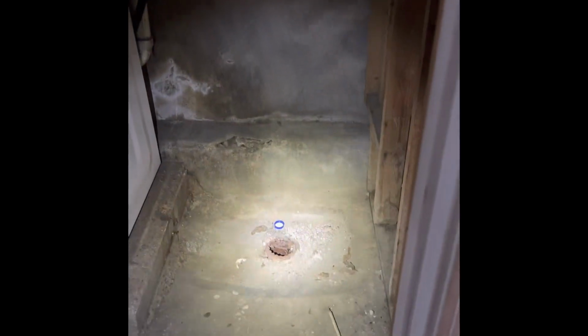We'll have to have a drain line. So my drain line is going to... let's see here. Is there a drain in the floor? Over here. Over there on that side? Okay. So a tankless water heater has to have a drain. So we'll have to run a piece of vinyl tubing from there across the floor over to here, if that's okay. Because the water heater condensates.